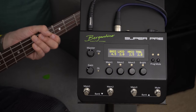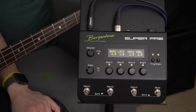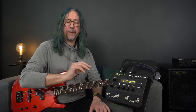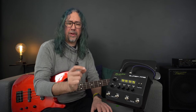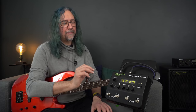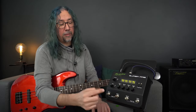In the middle we have a great OLED screen that is nice and bright and contrasting, so we're very likely to be able to see this on stage in front of us. We have four knobs that allow us to access each of the settings on screen. At the moment we have a four-band equalizer. What I really like about the Bergantino Super Pre — also echoed on the B-amp — is that the onboard EQ is a parametric equalizer. On many amplifiers the mid-control has a frequency selector, which is good, but on Super Pre we can access all four bands and set each frequency individually, and save those settings per scene.